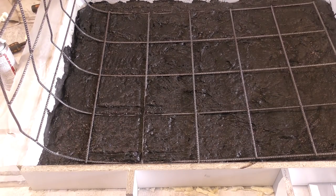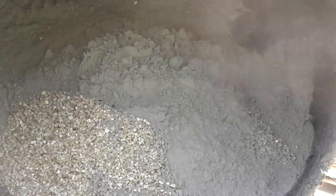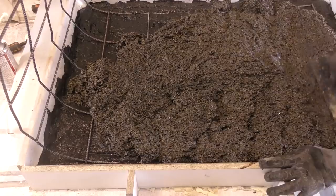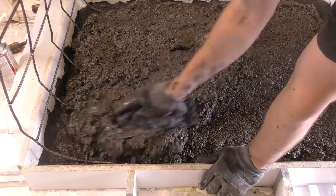And a little bit of rebar for strength, which you really do need. Now, to try and keep a little bit of the weight down, because I didn't want this thing to be stupid heavy, I put a center core of vermiculite, which is a really, really light expanded rock, which works really, really well, and it sets really, really hard. When I actually worked it out, using the vermiculite for just the core saved probably about 70 kilos on this thing, which adds up quite quickly. And it's still a relatively strong mix with this inside of it.